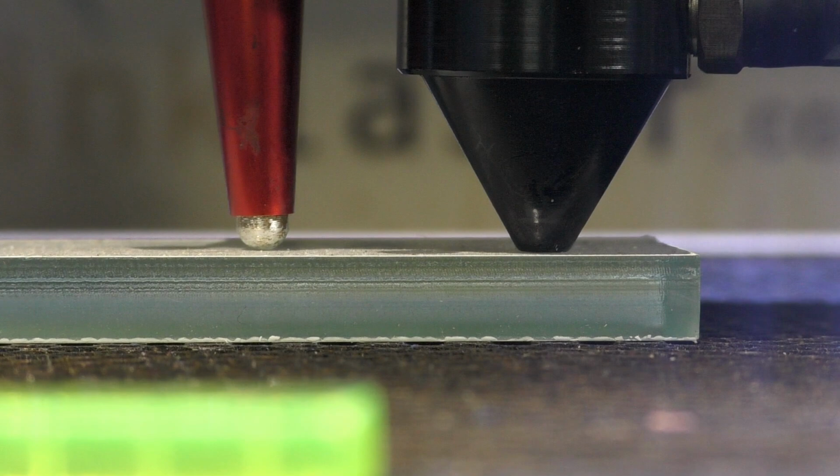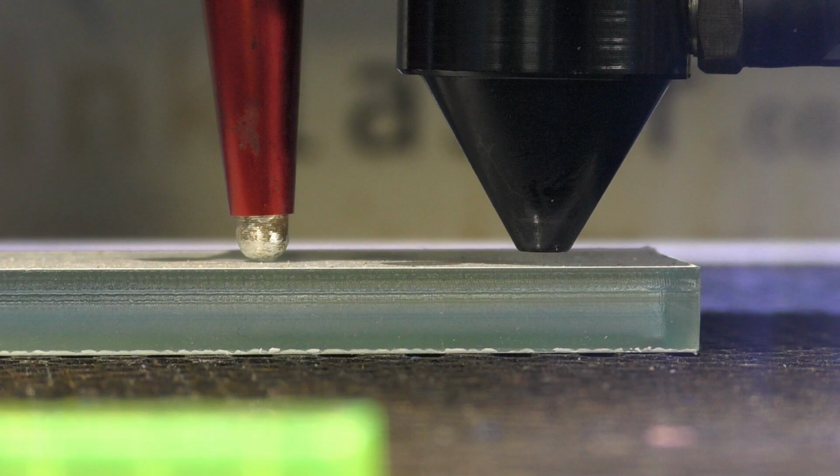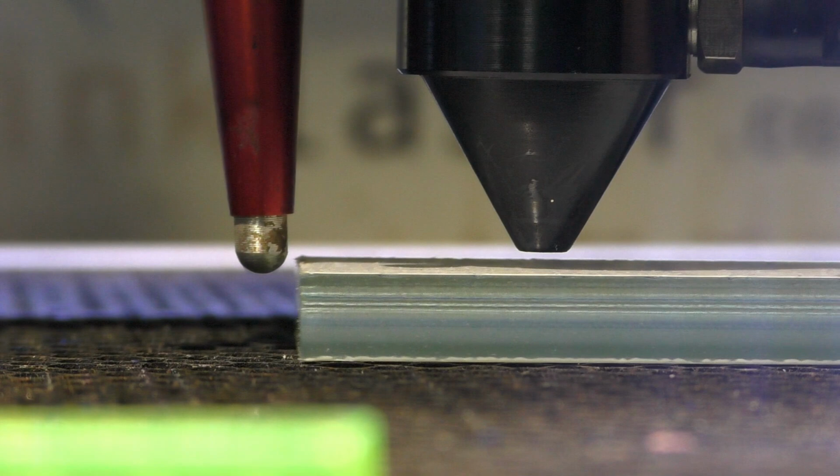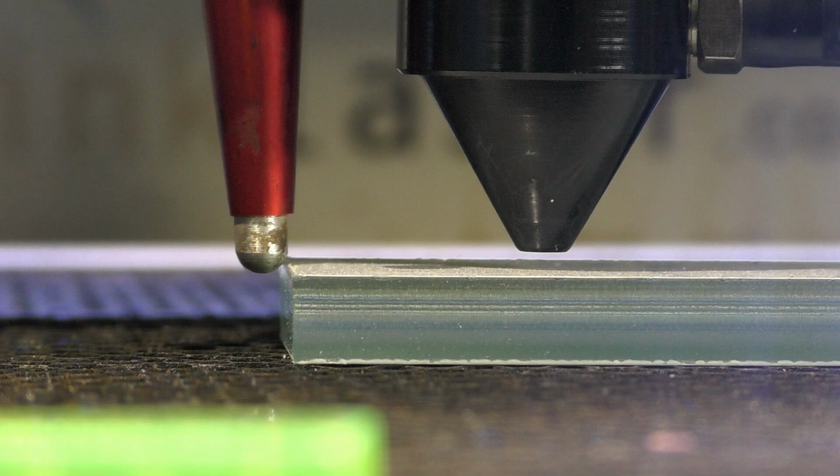Okay, the nozzle didn't crash. Now it's gone to the off position, where we see a 1.5 millimeter gap. That's the 1.5 millimeter gap I showed you on the diagram. Okay, but if we look again, and I pull this out the way, look, there's another 1 millimeter, or maybe 1.5 millimeters, of movement, of motion in the actual sensor itself. So I can't set my autofocus to that position, because it won't work. Remember, we're trying to set a 7 millimeter gap below the nozzle for our focus. So the fact that we've got 1.5 millimeters there means I've got to drop this by another 5.5 millimeters.